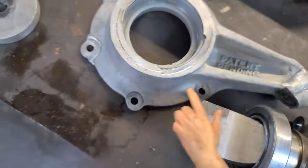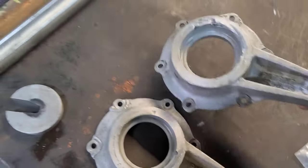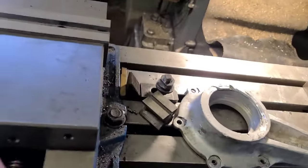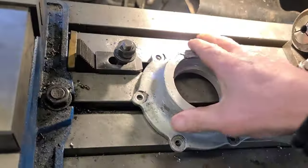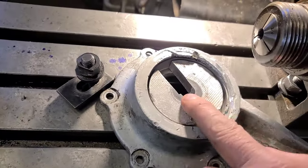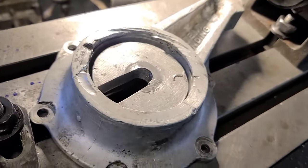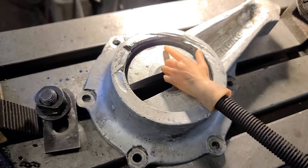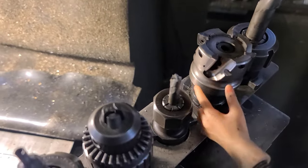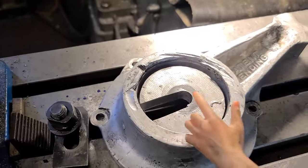So what I'll have to do is put these on the mill. Don't mind me, it's seven degrees outside today. I already got it figured out — I'm probably going to turn a little ledge on that. On the easy-track here I can have it cut a circle, mill a circle. So what I will probably do is use this two-inch cutter — it's a Mitsubishi — and then program it for a path.